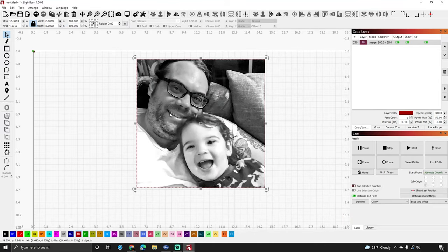One other cool thing — if you right-click and go to Preview, it shows you what your project is going to look like and where everything is going to burn. Zooming in with your scroll wheel gives you a close look; zooming out gives you an overview. It looks like this is going to take about 25 minutes for eight by eight on the CO2 laser. On a diode laser it would be much slower, but you get higher resolution. You can hit play and watch how it's going to burn. I'll hit OK and go align my piece of wood and send it to the laser.